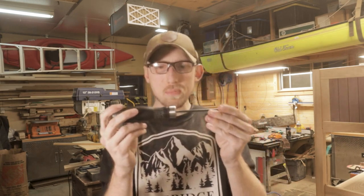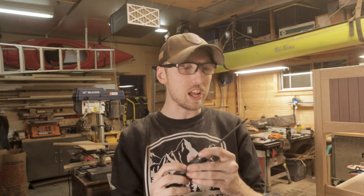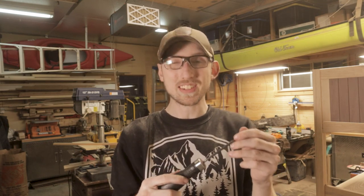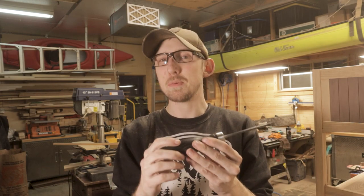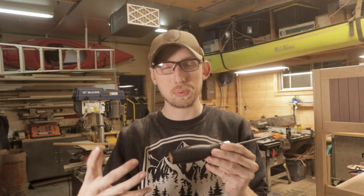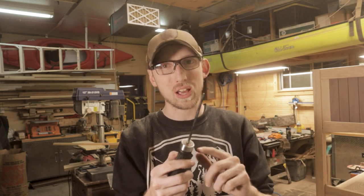Now, what I was really trying to mimic here was a burned finish. So as you guys know, I love burning stuff on the lathe. It's quite fun. I think I've talked about this recently. I don't think I've ever shown any video of it, but it's actually a pretty fun thing to do. But the problem is when you burn woods, especially a wood like white oak, it does have a tendency to split and crack. So you still get this really rich dark black color, but you do run that risk of splitting and cracking it, which I really didn't want to do, especially once you already have that metal on there.